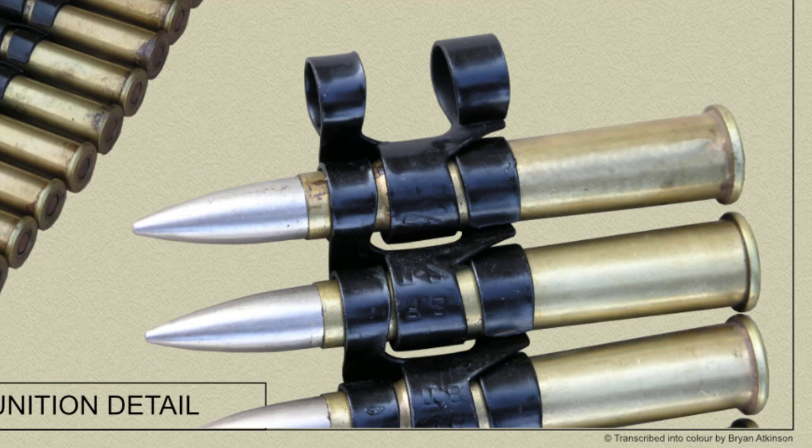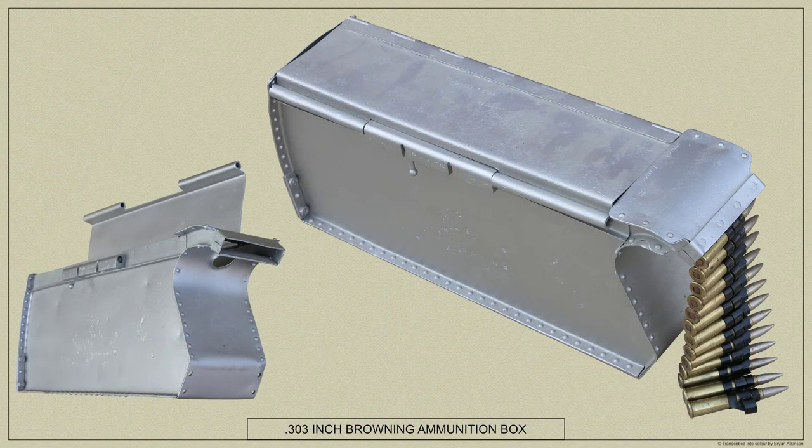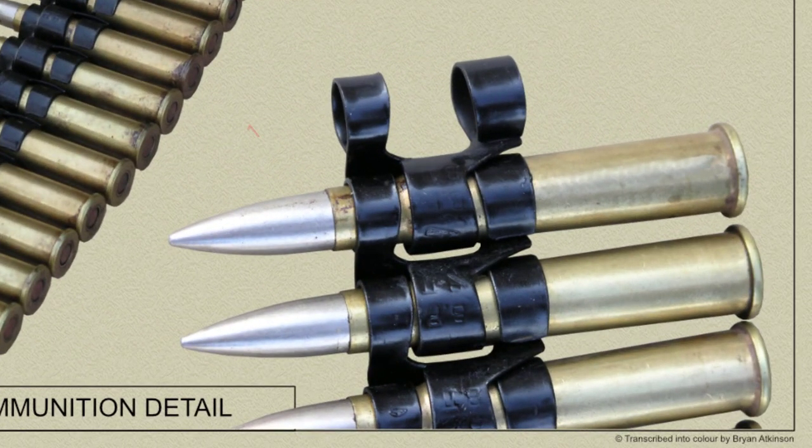When the ammunition belt is assembled, the single ring is positioned between the 2 rings of the next link, and the cartridge case, passing through the 3 rings, forms the axis pin of the 2 links, the whole constituting a hinge. Exact location is assured by a flange on the smallest ring pressing against the shoulder of the cartridge neck.